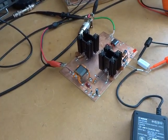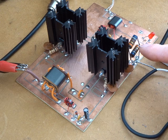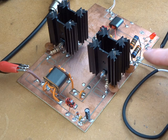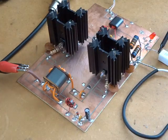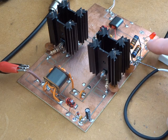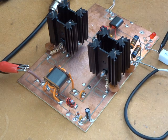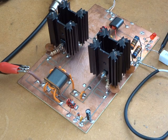I've got it set up. I've kept the simple divider biasing in place, and I've swapped out the existing 100 ohm resistor for two 680 ohm resistors in parallel — in other words, 340 ohms — providing the biasing current for the diode, which in turn sets up the current for the transistors. It turns out those two resistors are resulting in 320 milliamps quiescent current.